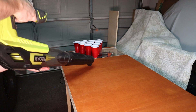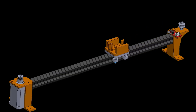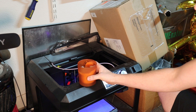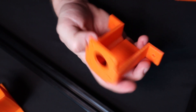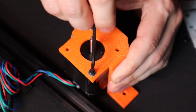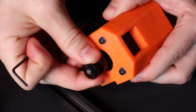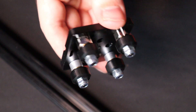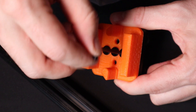I needed to think of a way to get the cups to oscillate back and forth, and my first idea didn't go so well. So the next logical step was to make this thing — a slider I designed in SolidWorks. After saying the usual prayer to my six-year-old MakerBot to please not skip steps, I was able to start assembling. The ends of the slider are 3D printed to hold the aluminum 2020 extrusion in place and fit around the stepper motor and limit switch. I found a cheap slider on Amazon that fits over the extrusion and designed a mounting plate to hold the cup.